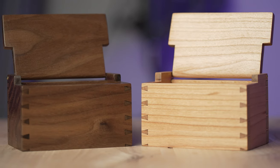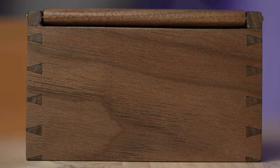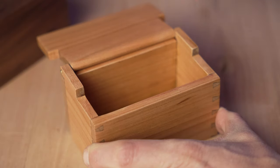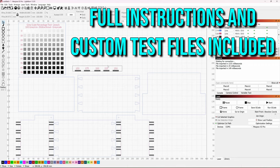I was going to call it quits, but I thought I could do better. So I went back and revisited those dovetails. I changed the kerf spacing and did some adjustments on the laser power, and the dovetails came out way cleaner. I also tried it in walnut, and those lines really did disappear — I think it looks really nice. Plus, I redesigned the lid so it opens up all the way, making it easier to get to your fancy salts. If you want to try making dovetails with your laser, I'll have the files for sale on my website to make this salt cellar.